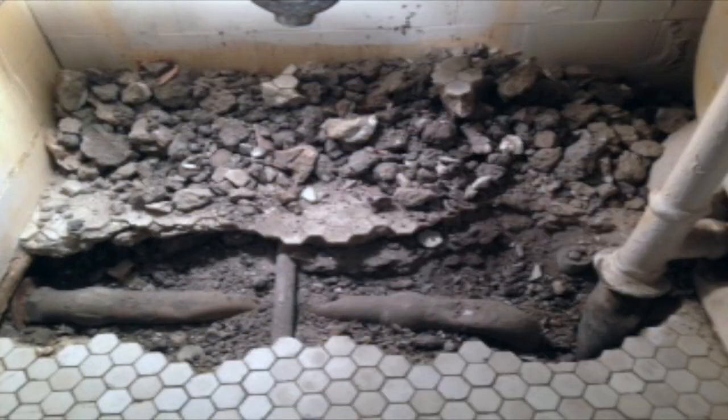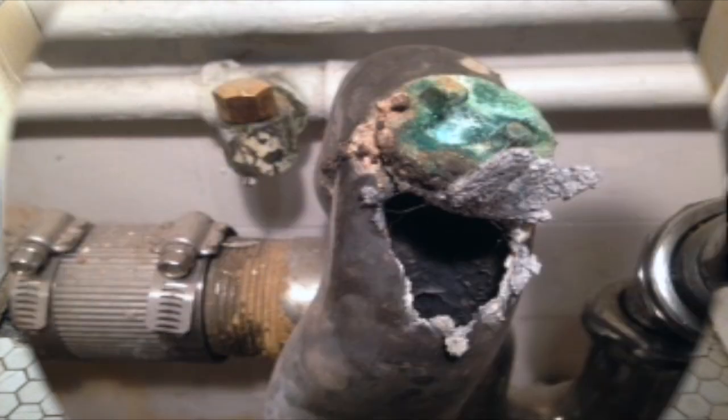I opened up the floor here. And as you can see, going right over the middle of that drain is a half-inch abandoned galvanized water line. On the left, the lead is actually soldered onto a solder nipple that's screwed into the cast iron waste stack. And on the right, you'll see the T that goes up to the overflow and takes care of the tub drain. In this shot here, you're going to see the blown-out trap — the snake went in there.